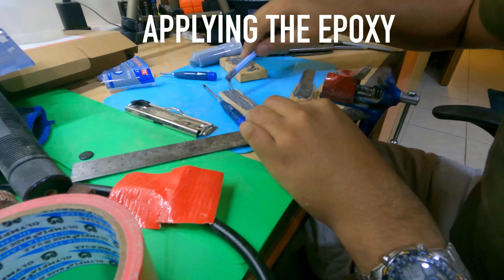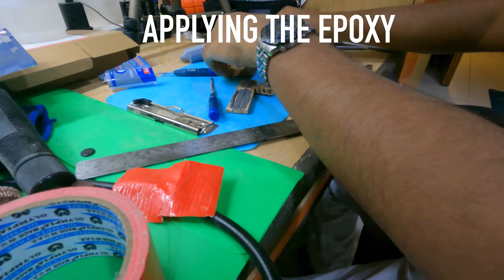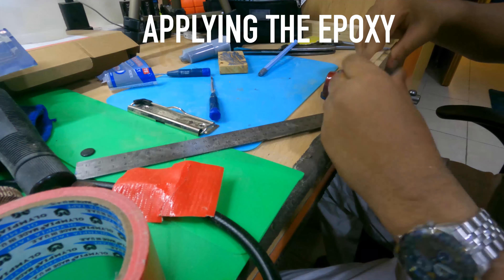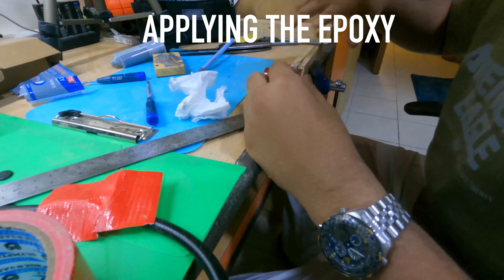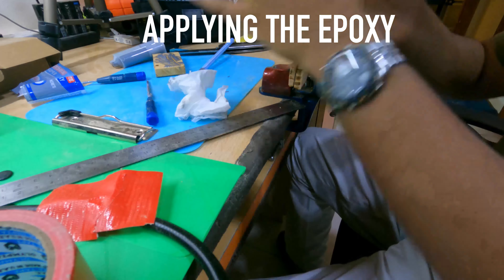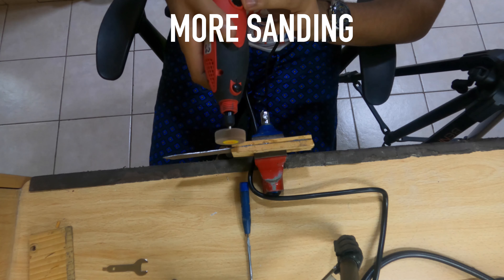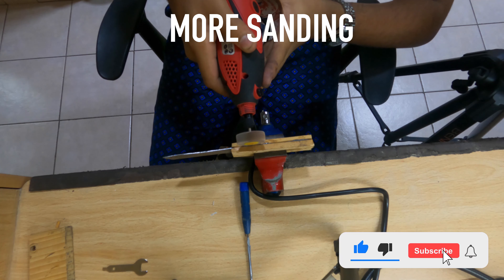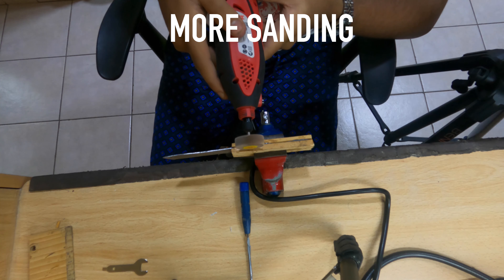Since I have to connect wood to metal, I use a two-part epoxy. I spread it out on every surface that needs to be connected, put the blade and handles together, check if they align, and eventually put it in the bench vise clamping them properly. Then I take an old rag and wipe off any excess. I come back with a flap sander and the Dremel turned up to max speed to tone down the edges and remove any squeezed-out epoxy. Since you've already seen this sanding and dremeling process, I'm just going to turn up the music.